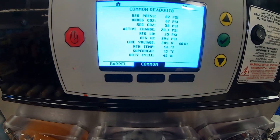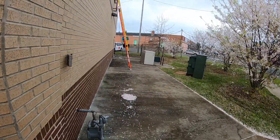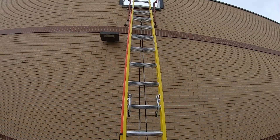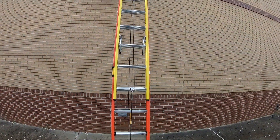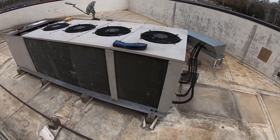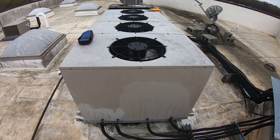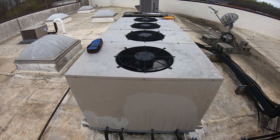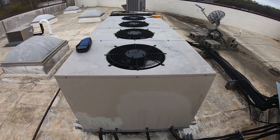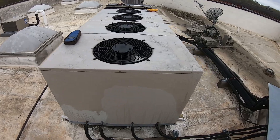We need to make sure the condensing fan is coming on. Got the ladder set up — going up to get to that condensing unit and see why the condensing fan isn't coming on. Up on the roof, the FBD machines are on the flex pack — this rear section here. There's a little condensing fan and receivers behind the panel. That fan has to be on. What I found was the fan was actually turning off when the other systems turned off.